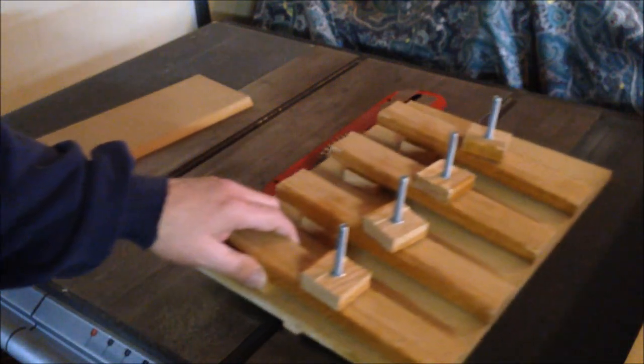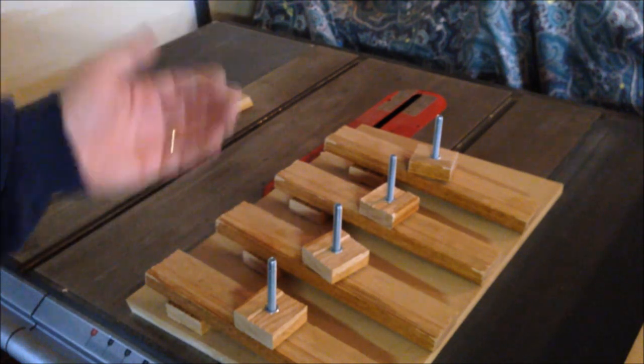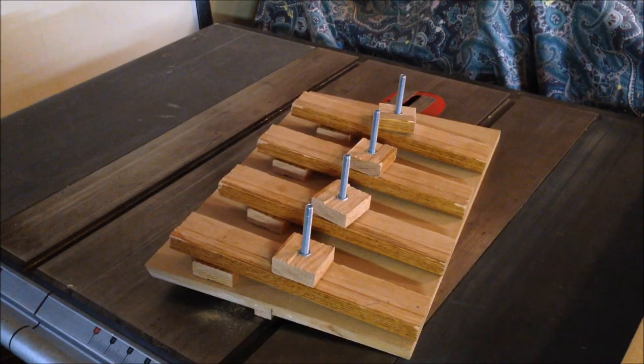Now that I've got my 30-degree angle cut on the back of the sled, I can reset my blade to 30 degrees at any time, clamp down a piece of wood on the back of the sled, and cut a perfect 30-degree angle. I really hope you guys enjoyed this video. A special thanks to Jay Bates — this is completely his idea — and I'll put a link to his video in the comments. I strongly urge you to go watch Jay's video if you're interested in making a small stock jointing jig. My plan is to start doing inside-out turning and Celtic knot pens, and this jig is my gateway to doing that. Thank you for watching — please subscribe, like the video, and any comments are more than welcome.